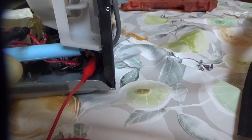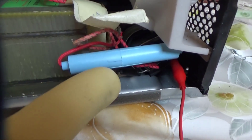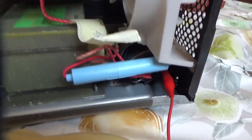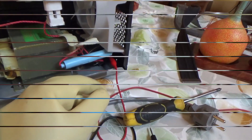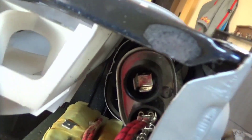I think we've been very lucky. I put the positive probe on one side of the fuse and the negative probe on the other side. It doesn't beep — it should be beeping and it doesn't. So in principle it's the fuse. Let's unscrew the fuse holder. Let's check the fuse, and if it's the fuse, it's the best thing that could have happened to us because it's the cheapest thing to fix.